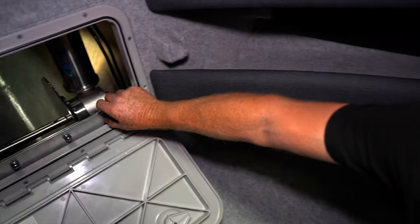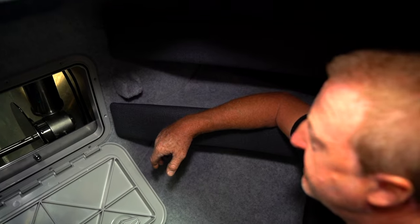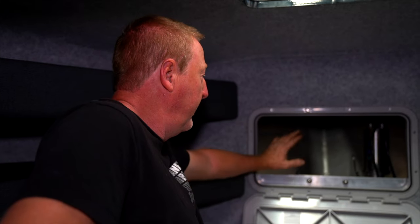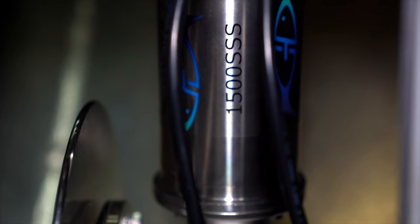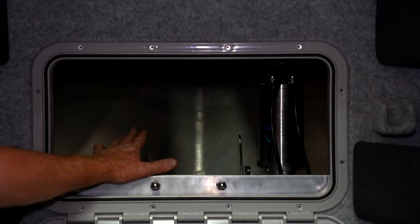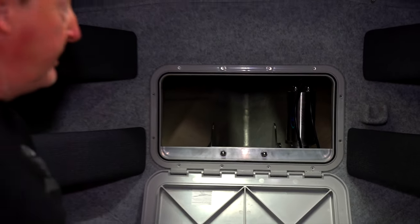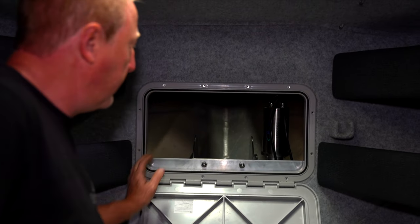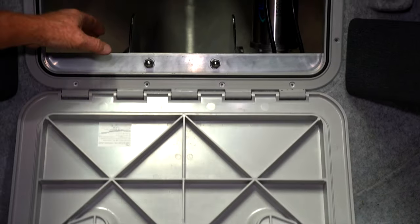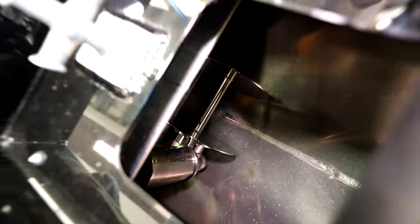On this particular fit-up, we've had to make an adapter plate to install this winch because it's been fitted with a hatch basically where the winch needs to go. So we've made an adapter. Here we have the 1500 SSS Savwinch mounted in the front of this extreme boat. I've had to make an adapter plate to fit the larger winch into this bulkhead — it's mounted through the adapter plate. The bottom bolts are mounted through the reinforcement of the boat itself and the bulkhead, so solid as a rock. All bolted, ready for some wiring.